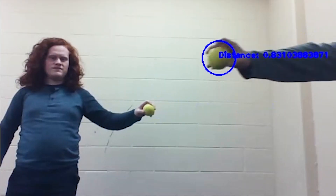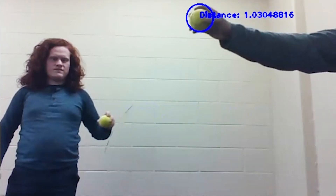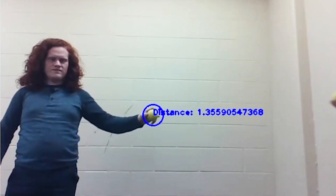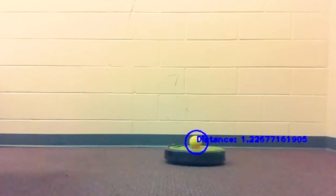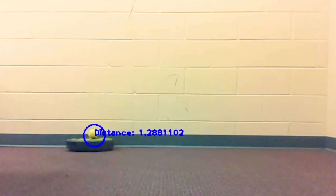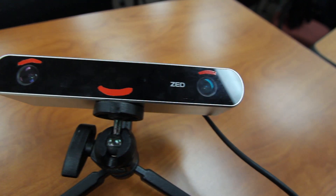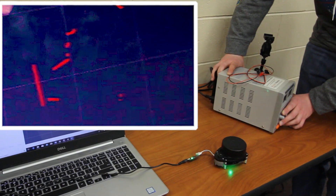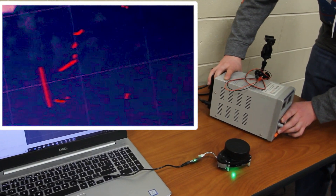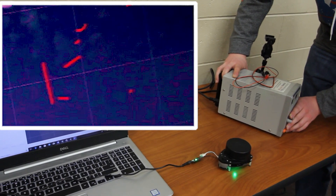Within the autonomous logic we have designed an algorithm that searches camera feeds for objects that resemble the roundness and hue of a tennis ball. Using this information we can not only detect goals during the autonomy task but also provide important feedback and visuals to drivers during many of the challenges in the competition. Specifically during the autonomous navigation task, we make use of a ZED stereo camera and LiDAR sensor to provide detailed information about the surrounding area. Utilizing point clouds from the ZED, we can separate obstacles from the ground plane and identify how best to avoid them.